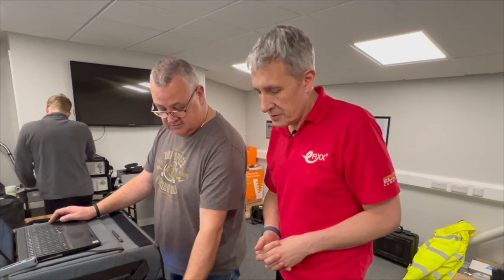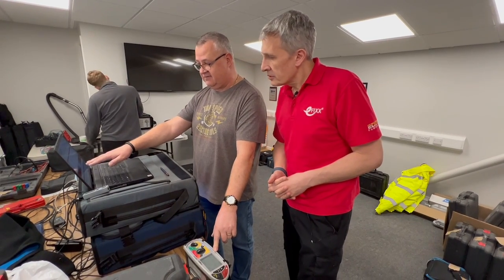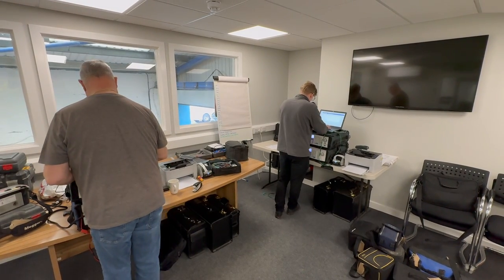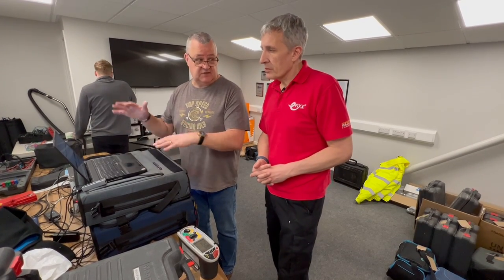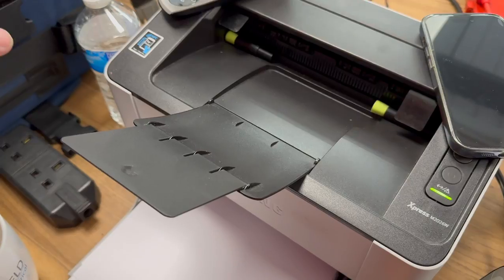Then we go from continuity to insulation. We're looking for 250 volts injected - it ought to be 250 volts or higher. The machine says it's injecting 266.6 volts, which is a pass. What sets the pass limit? It's the manufacturer's spec - normally plus or minus 10%, or plus or minus 5% depending on which model. Then if you're lucky you get a nice sticker and a certificate.